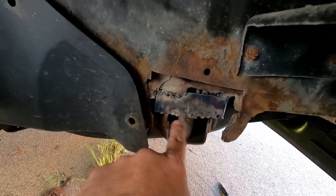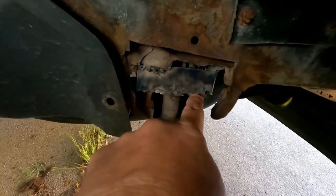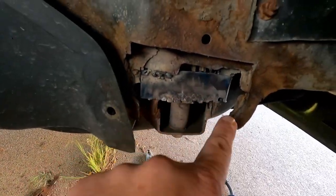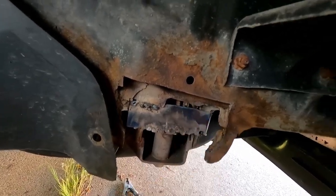We got her welded along here — looks like some boogers. I'm trying to weld upside down and I'm not the greatest welder to begin with, but welding upside down does not go very well. We got her done — it is welded all the way across here. I'm going to take the flapper disc and smooth that out so it looks halfway decent. Then I'm going to weld the front up and put some black paint on there to treat the metal so it doesn't rust out so quick. It's going to rust, it is what it is, but we're doing our best to slow it down.